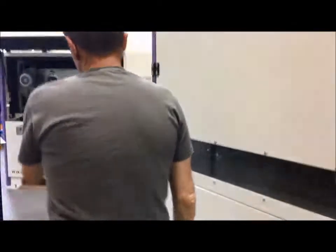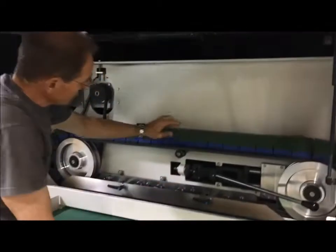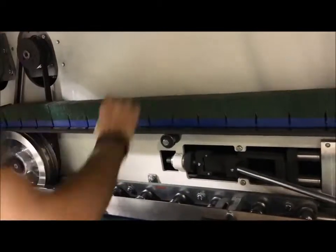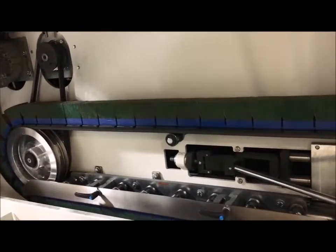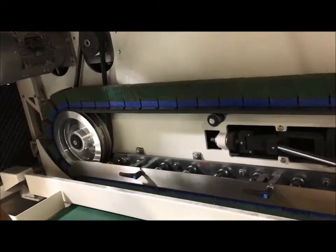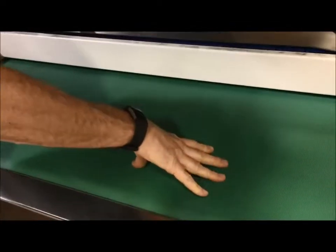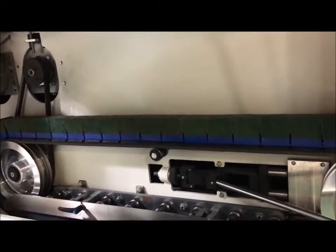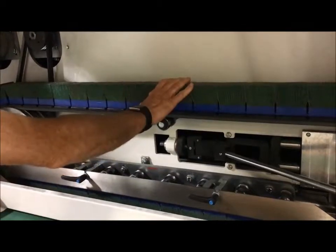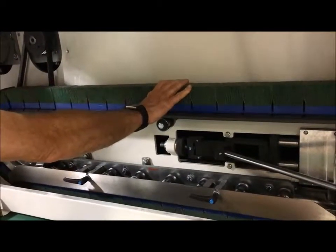And then we have, and that's where I'm leading to, this very simple cross belt machine, which has an abrasive block, alternating abrasive with Scotch-Brite, and the block goes round and round over the part. In your case, because you have very thin gauges, you will be in the conveyor belt. That's almost unavoidable. So the conveyor belt also becomes a consumable. This is a consumable of about $2 per hour. This is a consumable in your case of about $3 to $4 per hour. And this will do your edge rounding. This will not remove a lot of dross if you had it. It would give you round dross, but not no dross.